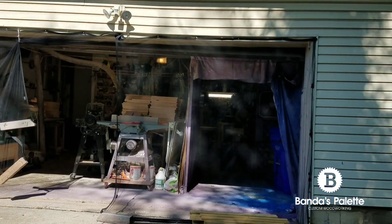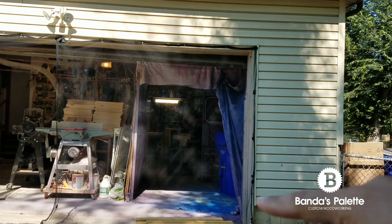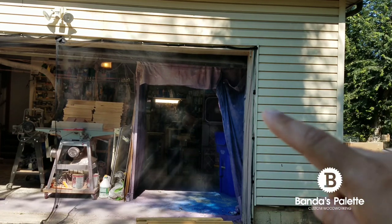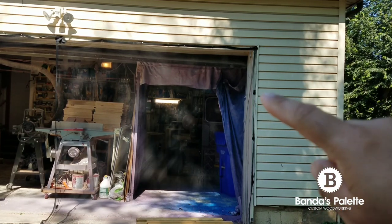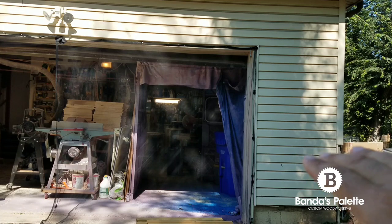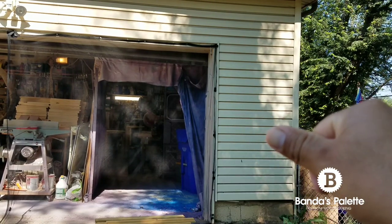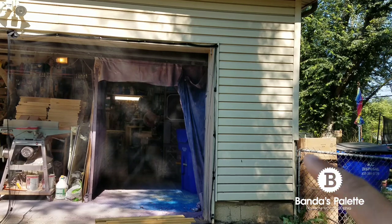And that's really all I need, just a little bit wider than a door width. But one thing I didn't mention is on the sides here, you're going to have some little Velcro pieces, and it comes with these little Velcro squares that have a sticky backing on them. What I found is, put the pad in the position where the Velcro is, and stick it onto the surface. Here's what I'd recommend: don't use staples to keep the pad on there, which I've done in the past. That's how I know this step. What you want to do is put the sticky pad onto the surface, and then using a small drill bit, pre-drill a little hole and put a screw in there.